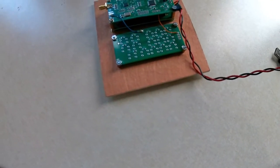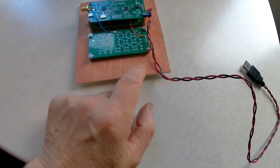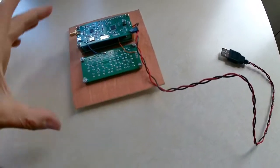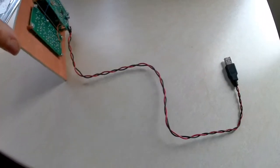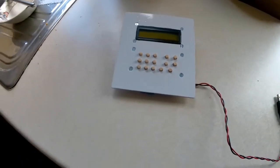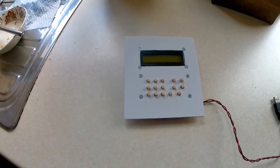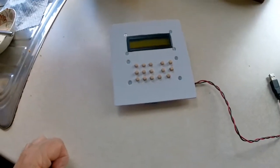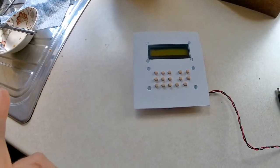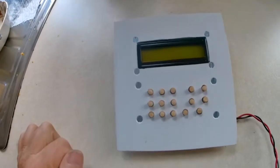Then I'll make a back box out of wood to go around the back, not very thick, and I'll line it with the copper again so it'll be like a piece of test kit. I might put a battery inside — an old USB power bank — in the back to give it power. Then I'll mark up the numbers and the controls. That's as much as I'm going to do on this video. In the description I'll put the manufacturer's information — it's 35 megahertz to 4 gigahertz and you can get it to sweep up or sweep down in whatever increments you set on the control panel.